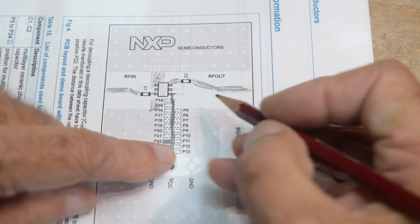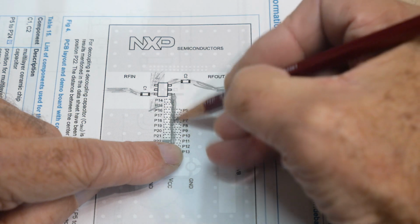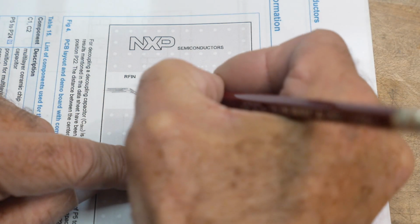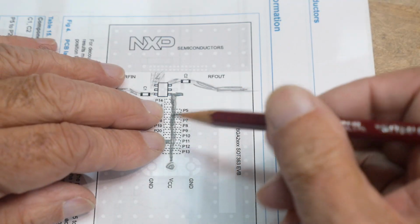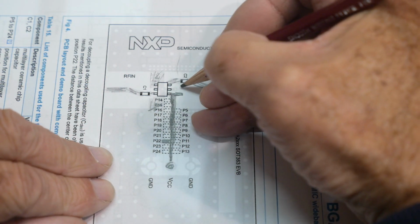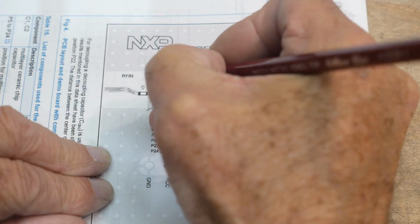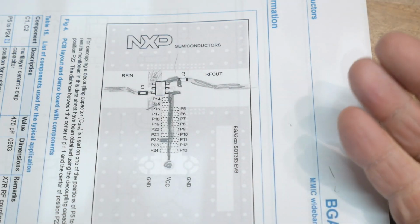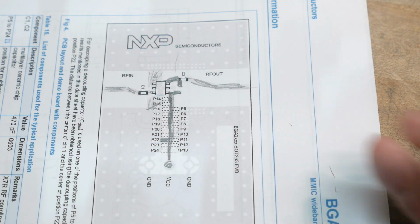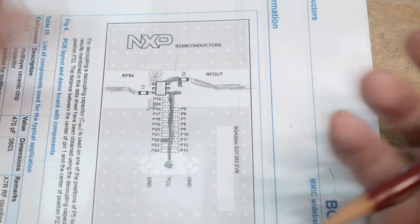So what does that do? Well, it sets up this long lead here, and I guess that's kind of like an inductor of sorts. And then there's this little tab here, if you didn't notice it. There's a little tab sticking out as well. So there's some shenanigans going on here. There's also a little tab right here on this trace. So these little stubs, a little stub there and a little stub there, those are just PC board trace material. They just go out and stop. They can act kind of like an inductor or capacitor or quarter wave stub. They act like different little things.